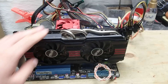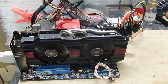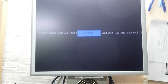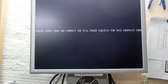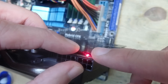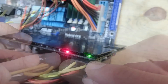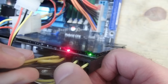The card is reassembled and back in the mainboard, power supply is connected. Time for another test. Hey — the fans are spinning and the LED on the monitor turned green! Unfortunately the 6-pin cable adapter seems not to be sufficient — the card says 'please power down and connect the PCI Express power cables.' The card has two LEDs which light red if no cables are connected. If I connect the 6-pin cable the LED turns green, but if I insert another 6-pin cable into the 8-pin connector the LED remains red — I definitely need a proper 8-pin cable.